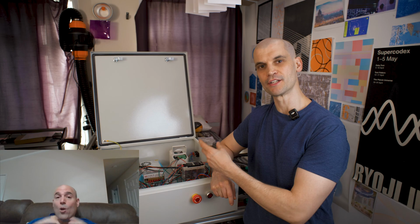Another quick point. We've seen in the video in the past that he's actually using ferrules to terminate his ground bus from all his leads from his shields. The thing about a ferrule is it's very small mass.